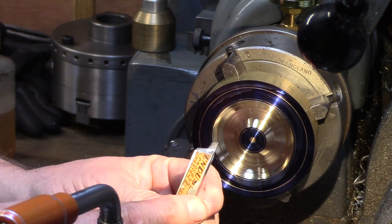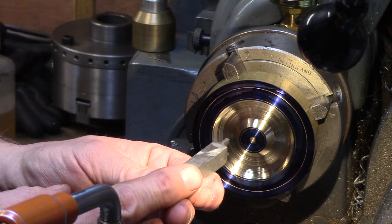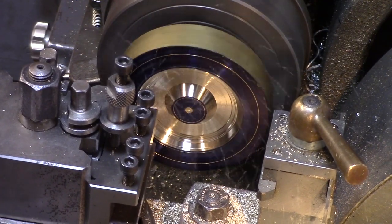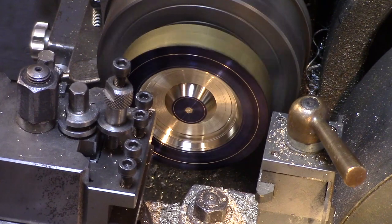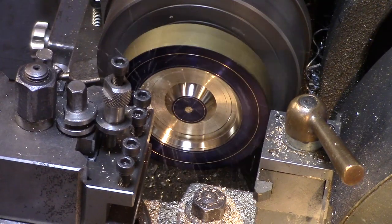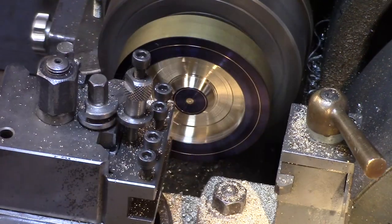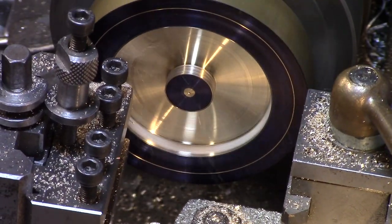I then used my high-speed steel trepanning cutter to turn away at the chamfers left behind by the first operation, to create the 90 degree internal angles in the flywheel recess and bring the dimension to size using the scribe lines as a reference. The central boss was also created by the same tool, and then the internal face was reduced to the 5mm depth as required.